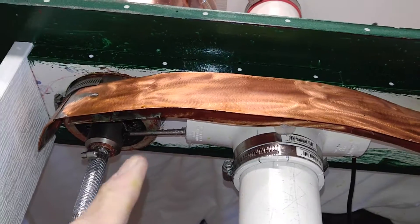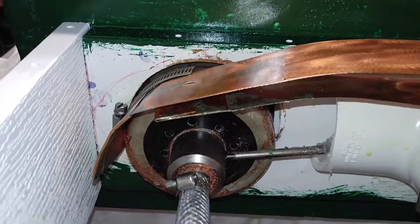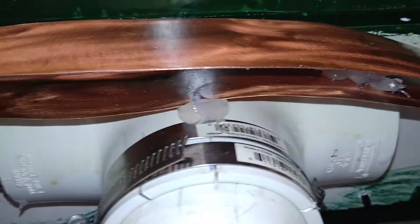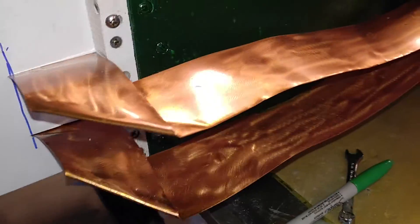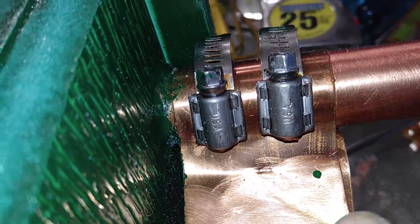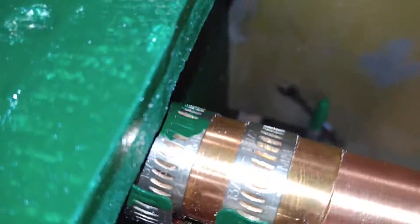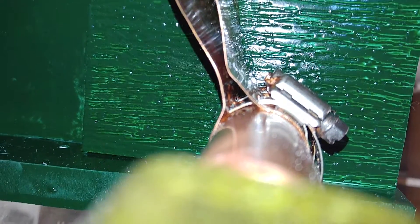The construction uses a lot of copper ribbon I made up. I cut this out of a sheet of copper — it's two inches by about 40 thousandths. I laid two copper sheets together to cut the inductance down. I made a heavy-duty conductor that comes out from the bottom of both capacitors, goes through this copper bus bar and comes up to the copper electrode. I took a Dremel tool and cut a slot into the copper on both sides so that the pipe clamp goes all the way around and grabs it really tight, giving a real good tight connection and really pinching the copper.